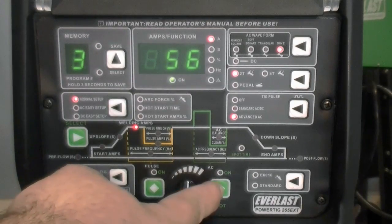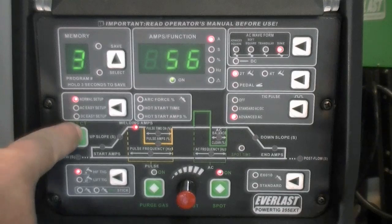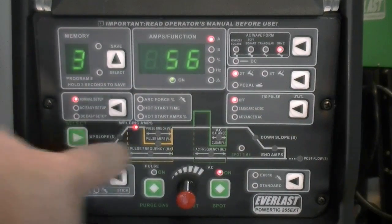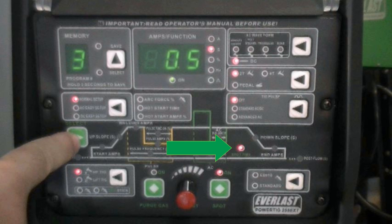To activate the spot weld timer, press the button until it lights. The spot weld timer is primarily designed for use in the 2T remote mode. This allows you to include settings of all weld cycle features. To set the actual spot weld timer, advance the select button until the spot weld timer light is lit in the panel graph.